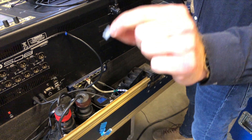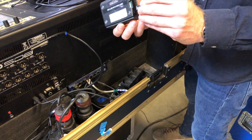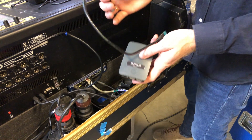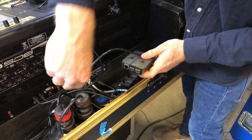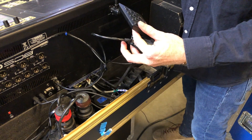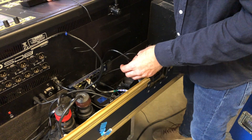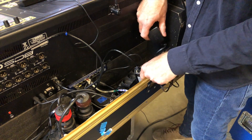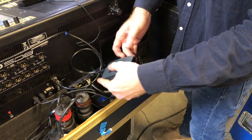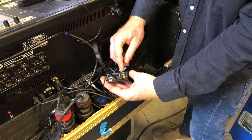After you have flashed your SD card, you need to connect everything up. Here I have the Raspberry Pi inside the case. I place the SD card like this. Then we take a normal Ethernet cable straight from the console port. Connect the USB plug to the Raspberry Pi. Connect the Stream Deck here using the USB plug. Place it anywhere where it fits your need — could be here on the SD8 console. Then connect the power and the system will boot. You can see the Ethernet will start to light up.